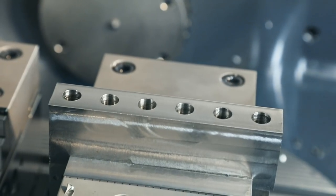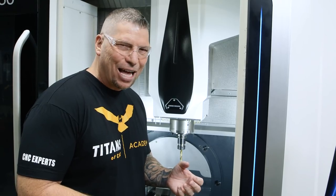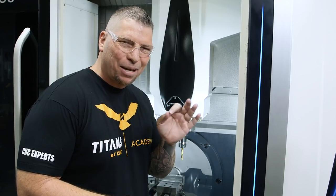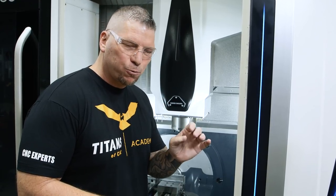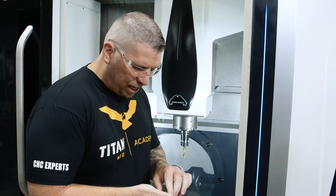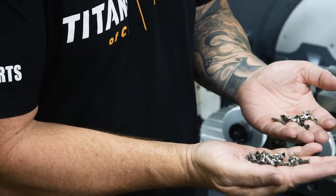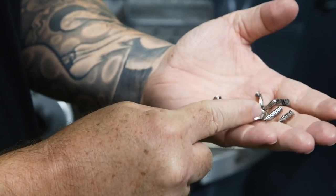Success. It was so quiet, right? It's nickel, but you didn't really hear that, you know what I mean? It was just so smooth like butter. We have this perfect surface foot and chip load. We got nice small chips right here. Chips look absolutely great. And that's how you drill Hastelloy.